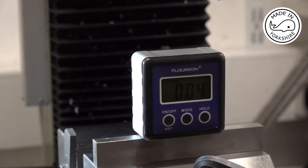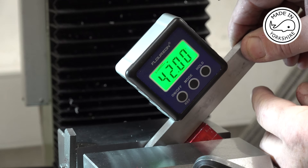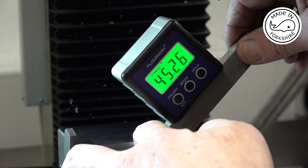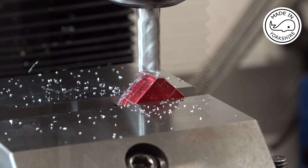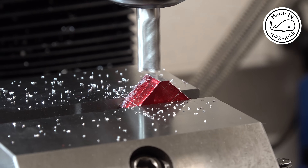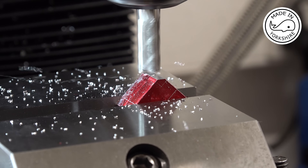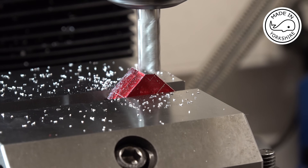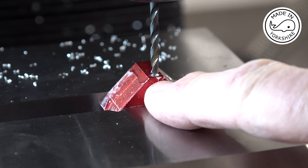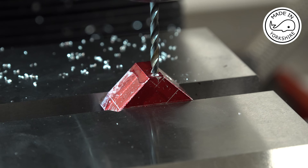So now I need to cut a 45 degree angle on the corner. It's looking pretty close. Now it's a matter of drilling with this eighth of an inch drill bit - I'm not going to ream it - to a depth of 0.312 of an inch.